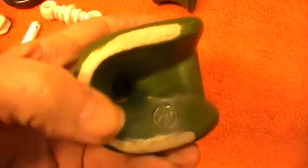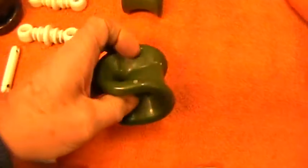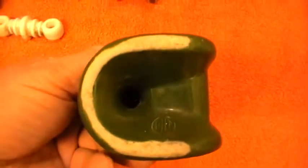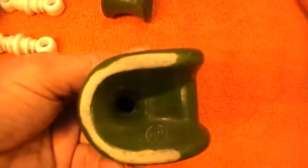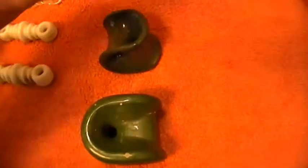It's made by a company called PHT which I've been unable to find out anything about. It's the largest shell insulator that I've got. The reason that part is white is that when these are made they're fired in a kiln, and that part would be where they stood down. They were glazed, but obviously they couldn't be glazed where they were rested. The same applies to the others — that's where they were laid in the kiln where they were fired.